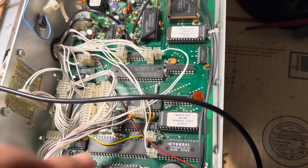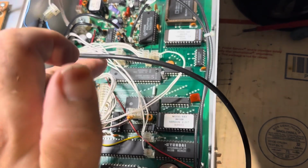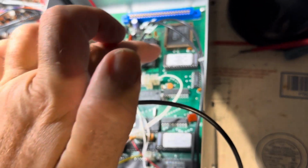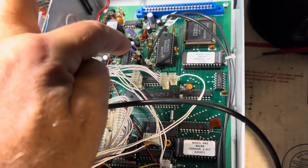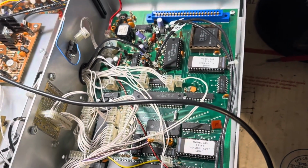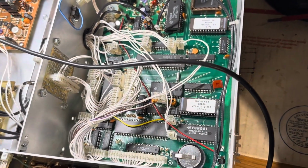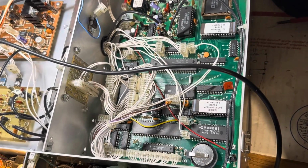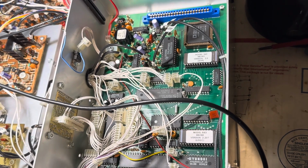I hit all the joints on this mux thing here that does the I/O. I think I hit them all on this guy on the CPU. Hit a bunch on that. I also pulled out every single chip and resocketed. I didn't pull a DSP out, but I pulled out this chip here. I pulled out the DSP firmware and the regular running firmware here for the board. Pulled those out and reseated those. Anyway, I'm not sure what was glitching this thing. I have no idea, but did a bunch of resoldering on the bottom of the board.